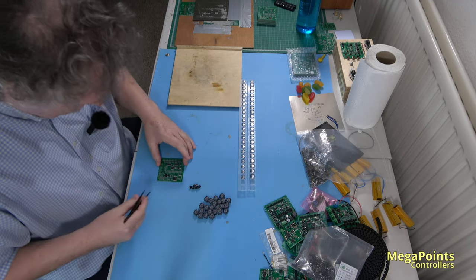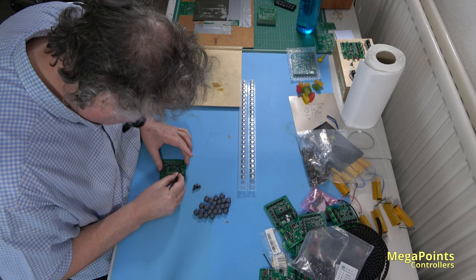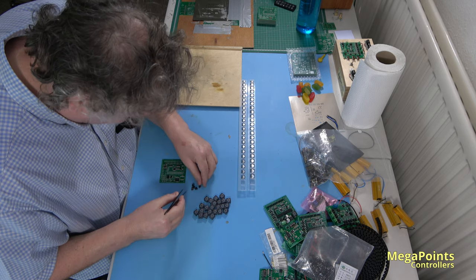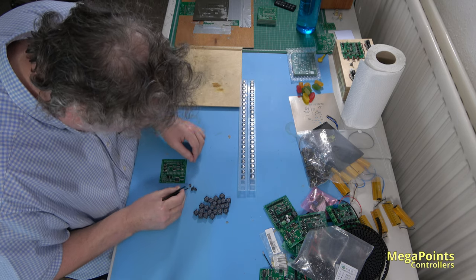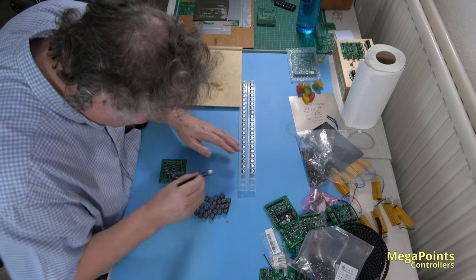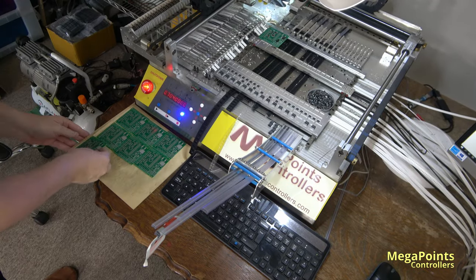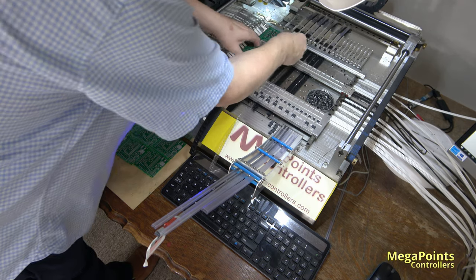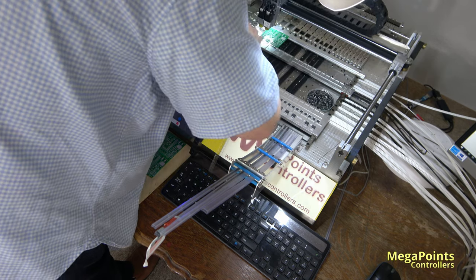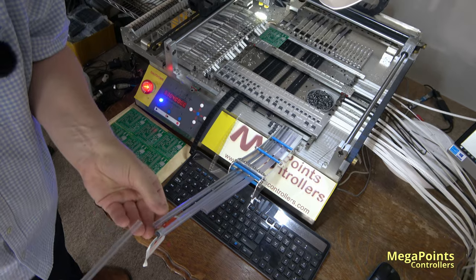There's another board looking good, everything's on in the right place, nothing out of alignment. Just poke that diode a bit. Buttons on, 330 microfarad cap, 680 microfarad cap. Yep. And there's the manager. I'll let you see a board. Grab a blank. Take the old one off, fit the new one. And go. Check, yep, that's good. While I'm here, the tube feeder needs some more of these buffer chips. I'll just slot them in here, and these are gravity fed.